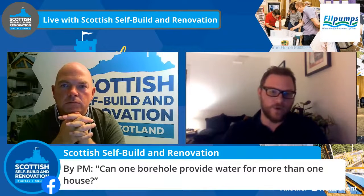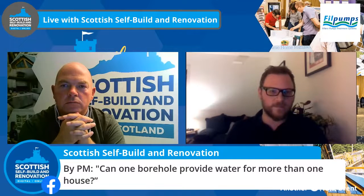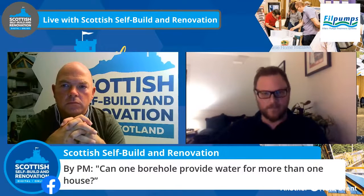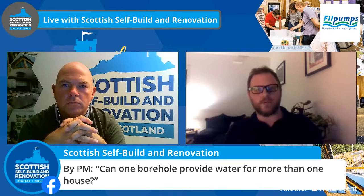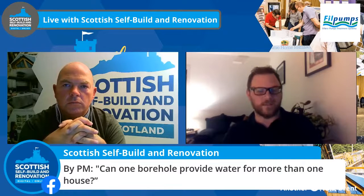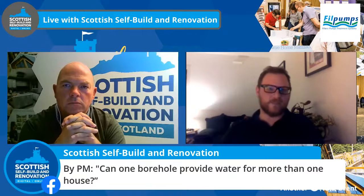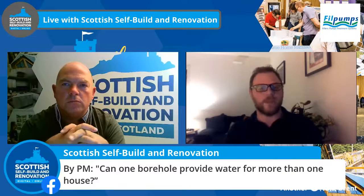The benefit of a borehole is, as mentioned in the presentation, it's a regular, consistent flow of water. Even if the borehole per minute isn't able to get the water out of the ground to meet the live demands of the property, as long as in a 24-hour period the water can provide, say, 15, 20,000 litres, you can make use of other infrastructure such as tanks and then have it boosted out from there to the property.